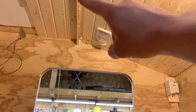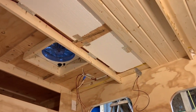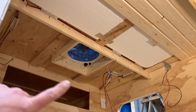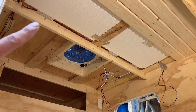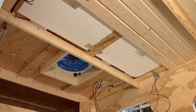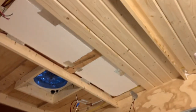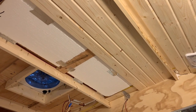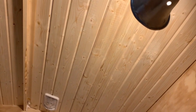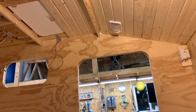I'm missing one board right here that's going to have to be cut to a different width than the rest. I've got one-by-four strips placed in here periodically. Same as the walls and same as the floor, I'm filling the gaps with three-quarter inch foam board and then going over top of that with the top coat. The top is just one-by-four pine boards. It's not tongue and groove — all I'm doing is running it on the table saw to put a little chamfer on each side. Makes it really easy. Cut them all the same length and run a bunch through there.